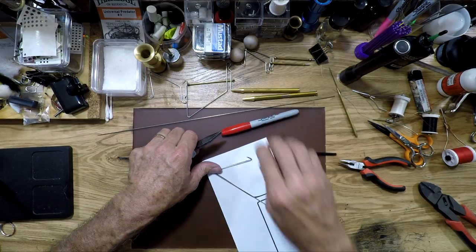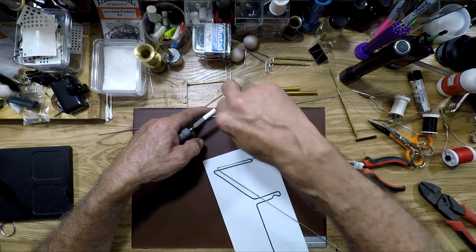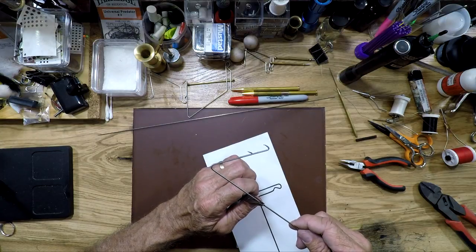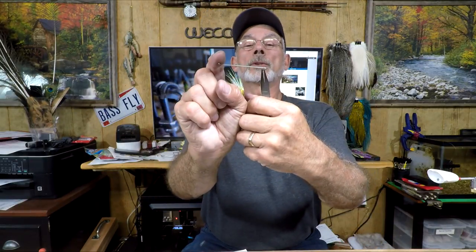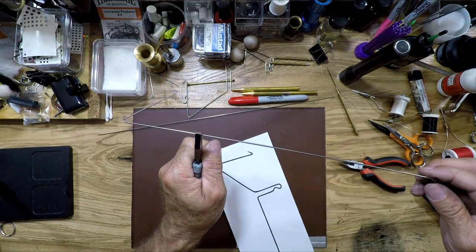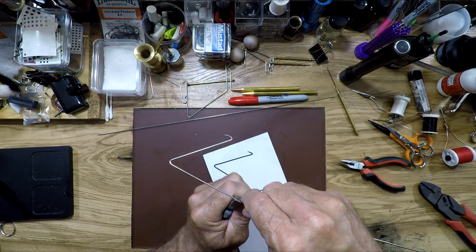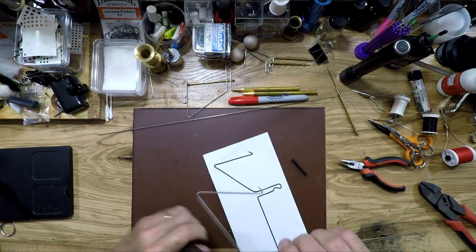You've got that much of it done. Now come over and mark your next bend. Mark these bends as you go — don't mark them all at once because your bends are going to move on you. Grab it and make sure you have it straight by loosening up on the plier, and try to get it as straight as possible. Then put your split pin back on and make your next bend — this bend here is going to be parallel to the one out here.